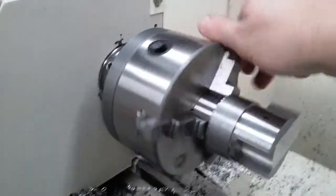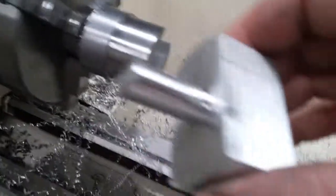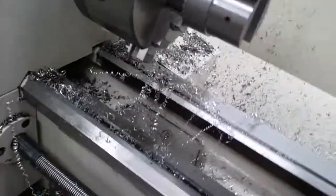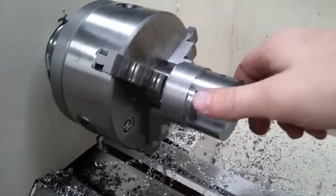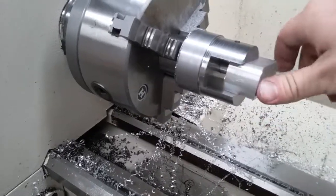Have different dowel pins set up. As far as milling a flat, I do have an XY table for that drill press, but I may go other routes to mill the flat on the post because you're going to need a flat there for the set screw. As far as the lathe end of everything, this is working out really well. I'll face them off so they're all the same length — now that I have the DRO that'll make that nice and easy.